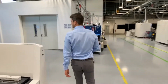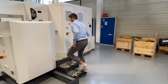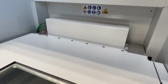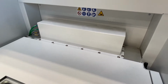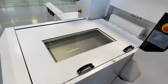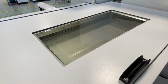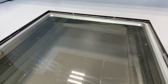The powder reservoir is docked to the rear of the machine in form of a separate dosing module, the so-called flexible dispenser. The connection between the process chamber and the dispenser is completely inerted. The flexible dispenser has a capacity of 80 liters of powder material, sufficient for any build job design. The flexible dispenser contains a lifting unit and a recoater. The lifting unit adjusts the quantity of powder, which was previously calculated by EOS Print.